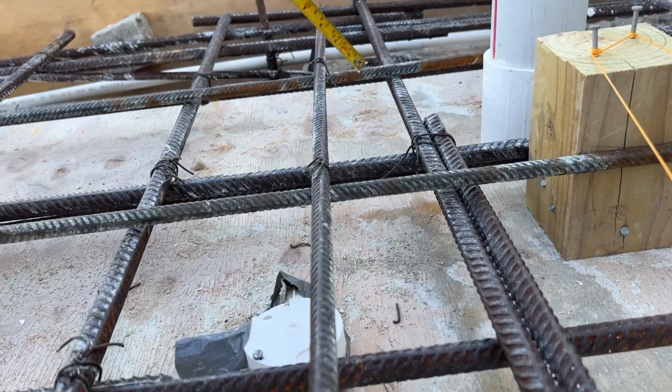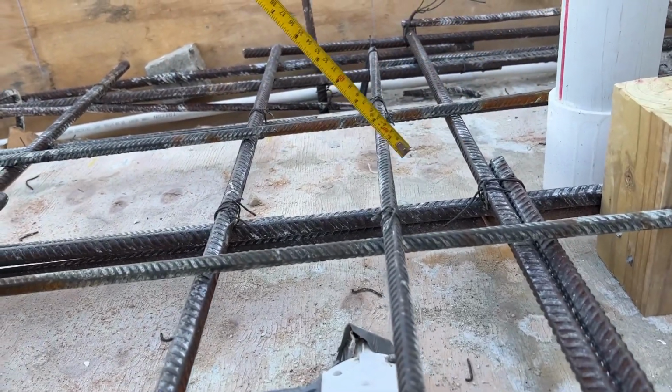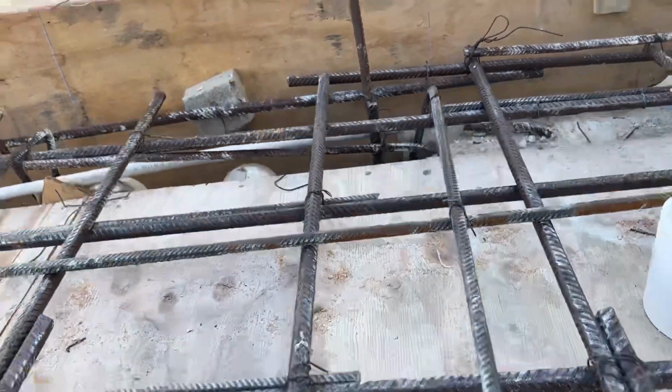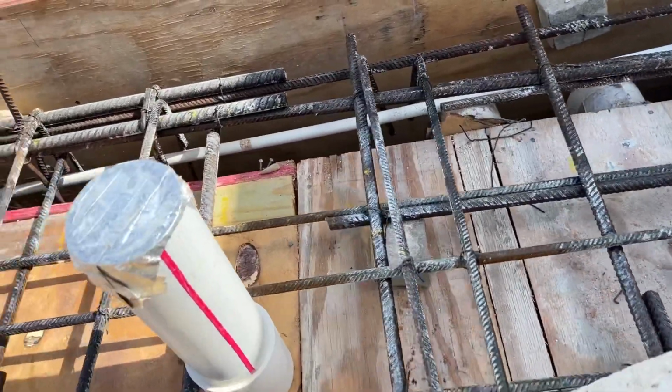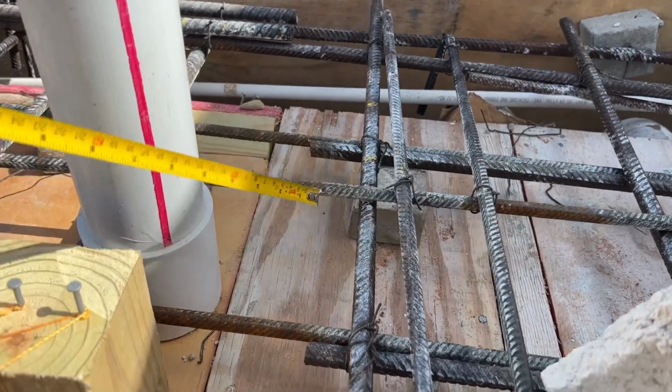And again, really, this bit should be removed, because what we're going to do is the actual drain element through here. So really, this should be lower. Otherwise, you're going to end up not being able to do the French drain properly. You're not able to do the wipeout properly because these are in the way. So really, these should be underneath.